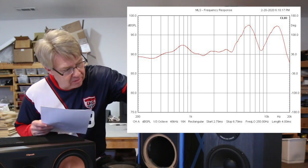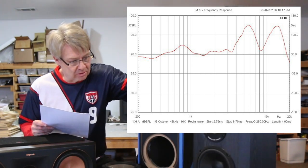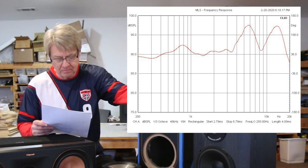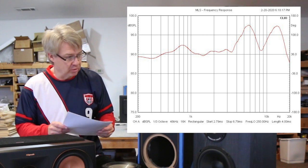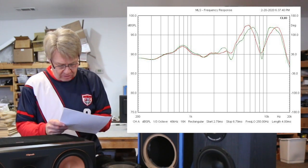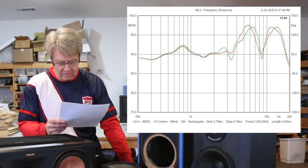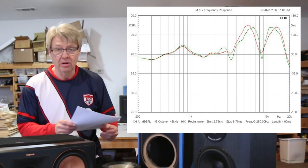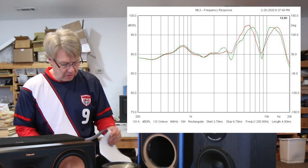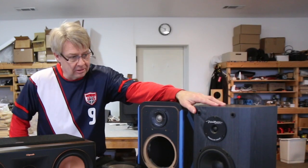Those are pretty big peaks — almost 7–8dB. Some of it may have to do with diffraction; they did not flush-mount the drivers in this model, they're just surface-mounting, which causes ripples in the response around the tweeter. But probably not all of it is diffraction — the tweeter has some peaks in it. The grill had very little effect; there was a little up-and-down around 2,800–3,400Hz that the grill caused, but nothing compared to the overall frequency response issues.